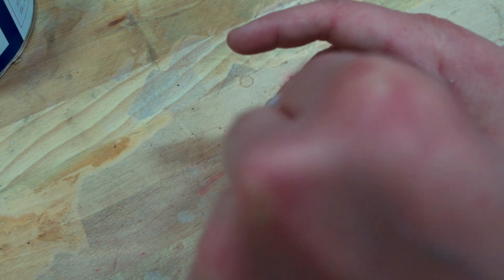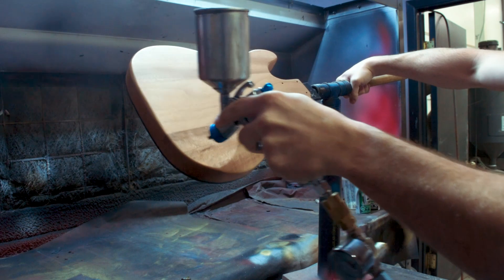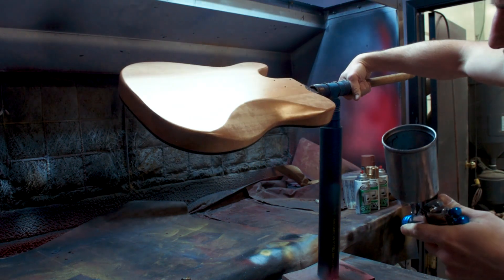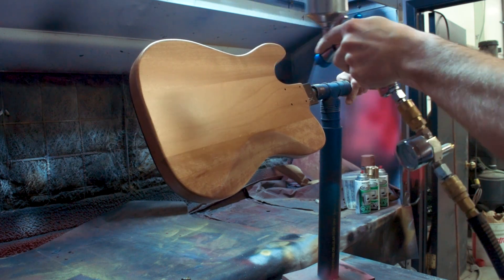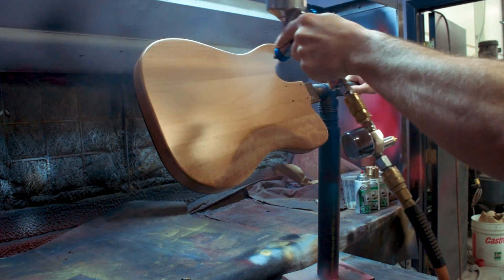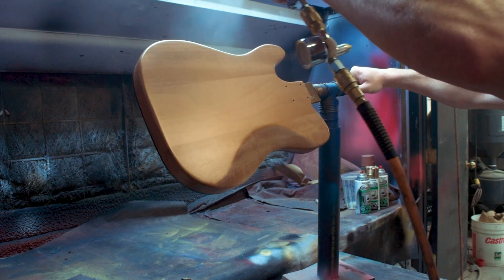I want something brighter, nice and gold, to match that little hint of gold that's stuck in the grain on the ash burl on the front. I'm going to spray this exclusively on the back of the guitar. After several coats this produces a very cool effect in my opinion, so I'm doing just the back and leaving the sides natural. I've got this mixed light enough that it's actually going on transparent but still has that golden hue. As I build up coats — and this is not sped up either, this is how fast I'm actually doing it — I'm spraying some air at it to make sure it dries quickly. Nitro lacquer dries so fast that you can recoat very quickly, so I'm putting those coats on nice and light to build up the effect gradually across many coats.